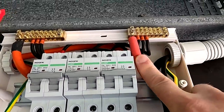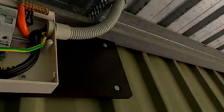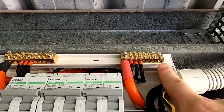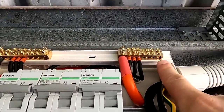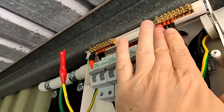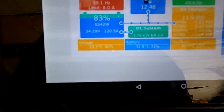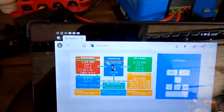I just realized I totally forgot to look at the hot spot on the positive exit from the bus bar last night. What I'll do is take this cable off and put it on the other side of the bus bar — there's a 16mm screw terminal there, which rotates the cable inside the terminal and gives a different contact area. We've got 41 degrees outside the garage, 33 inside, and 33 inside the battery. This is probably peak temperature for today, so it doesn't get hotter.